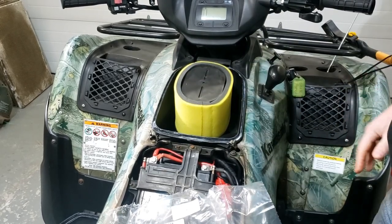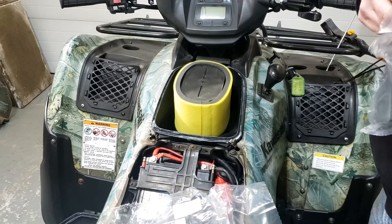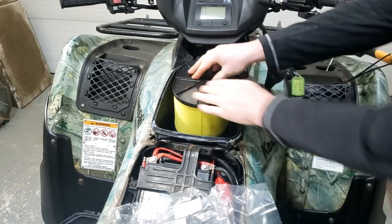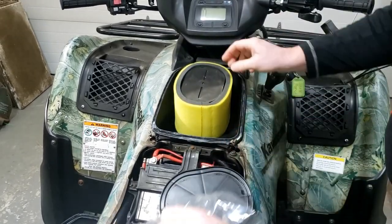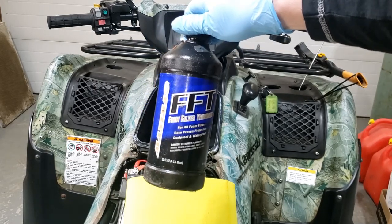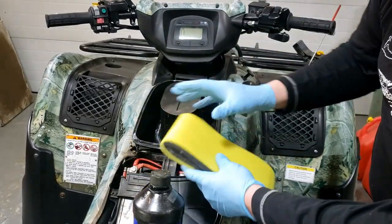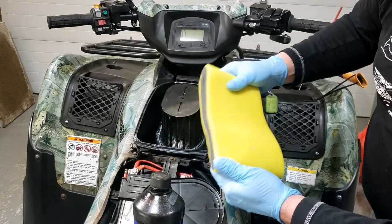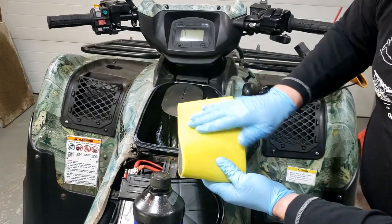That's nice — that's better. Turn the lid on top and then screw in the bolt. That's how it's supposed to look. I'll have to oil this up though. This is what I've been using — foam filter oil — for ages. Never had an issue with it. Just pour it on the filter and squish it all in. Squish all the excess out. Don't wring it. And then it's good to go, but you've got to make sure that you get the excess out of there or it's going to be too thick and it won't breathe at all.